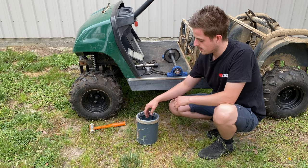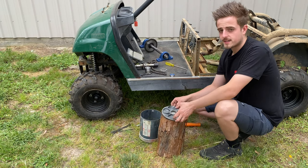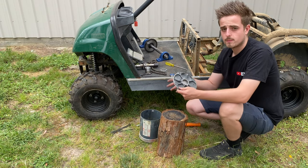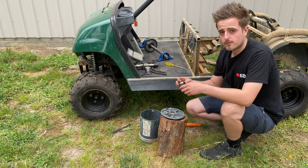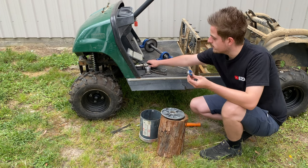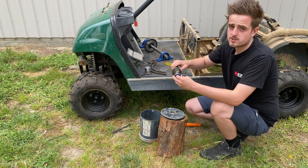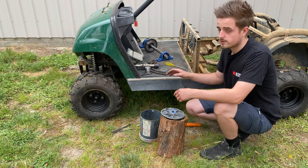The next thing we'll do is put that new bearing in, cut an access hole out, and put the motor on. I've taken the cover off the back — as I mentioned last time, I sandblasted all this and cleaned it all up, so it's a lot nicer now. I've got this 6203 bearing, it's a pretty generic bearing, that goes on the end of there so it keeps that shaft running nice and true. I'll tap this in and then put that little retainer on.